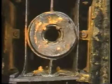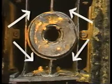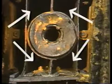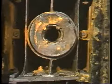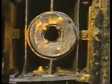Burner openings in the water wall contain air ports that supply combustion air to the furnace. Sometimes air ports are built directly into the burner. These should be inspected to make sure they are clear and are allowing a free flow of gas. Also, make sure they're not deformed. Deformed air ports alter the correct pattern of air flow.